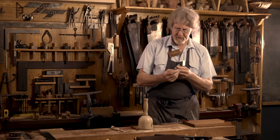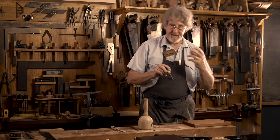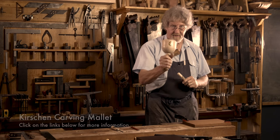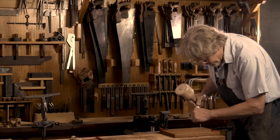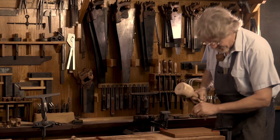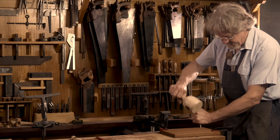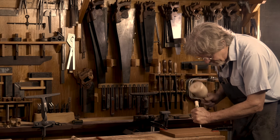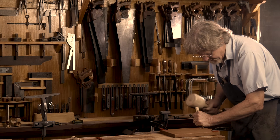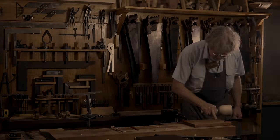Really important thing with this is to make sure that those top corners don't disappear underneath the surface of the wood, because if they do you're going to just tear great chunks out. So you've got to be mindful of that. It's all about keeping the tool at the right angle. So I'm going to use a carving mallet here for this job. Now this hand is down quite low because I need to be pushing to keep the bevel engaged — keep a nice strong push down into there. The twig's going to be wider at the bottom end, so I'm going to go in deep. Lots of nice small cuts. As I come out here, I'm going to gradually lower the tool down so it disappears.